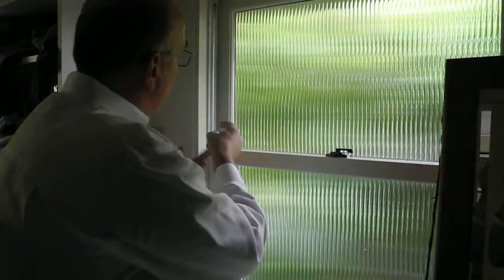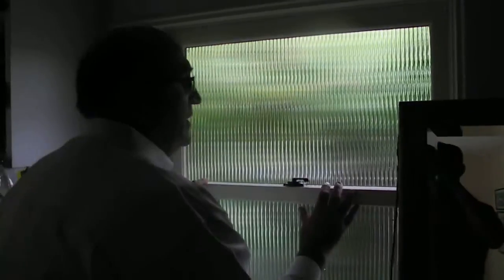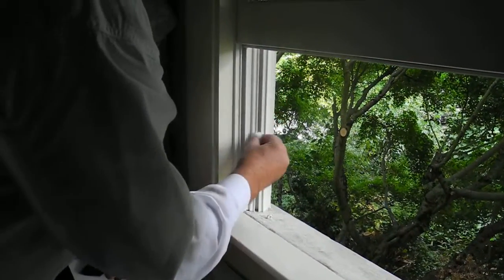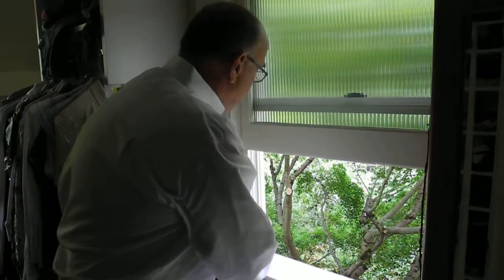It's kind of like waxing a pair of skis — you put it on the surface and as you lift it up and down you'll eventually get a waxy surface on all of both the tracks and the window. You can do it on old double-hung windows that don't have these tracks, and even on drawers. The operation is clearly much better.